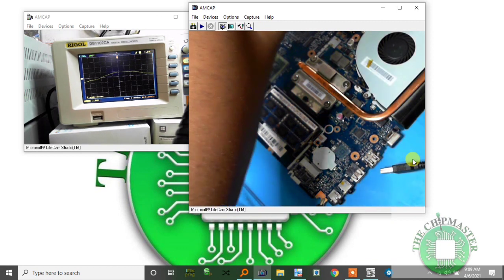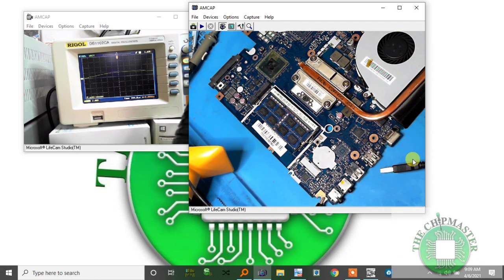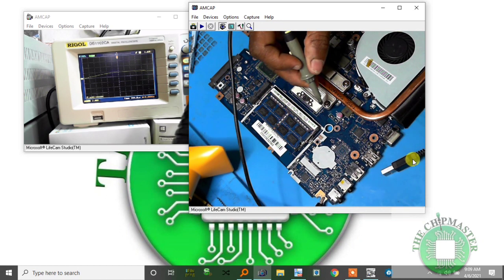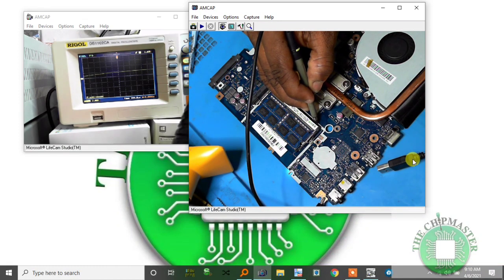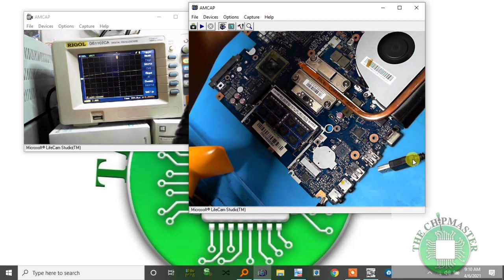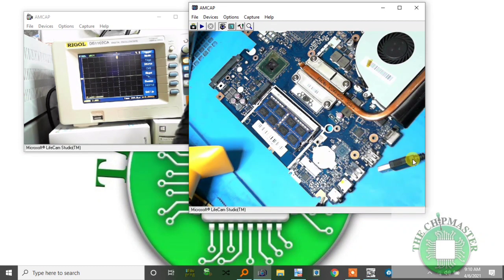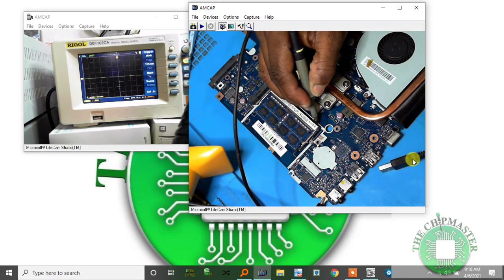First, flash the BIOS. Normally, when the RAM doesn't read, flash the BIOS. If it's flashed and it's still not reading, then replace the PCH. Last, replace the CPU. Alright, so let's go again. Pin 200 this time. And there's no response. Oh, I'm on Ryzen Edge. But regardless, it should at least try to turn on. It should at least capture the signal.